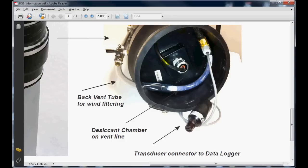The cable loops around on the inside, then goes through a pressure gland here, and this is set up so that the pressure transducer sits upright into the bottom of the precipitation gauge and picks up any change in fluid level as the snow drops into the antifreeze preload and the level changes as it melts. We can see also on the left side the valve assembly and part of the sight tube coming off here above the valve assembly.